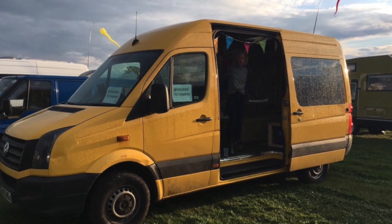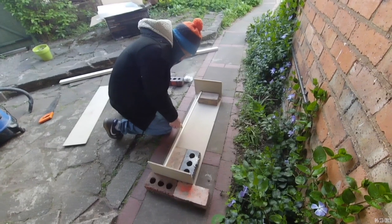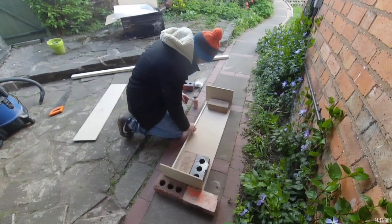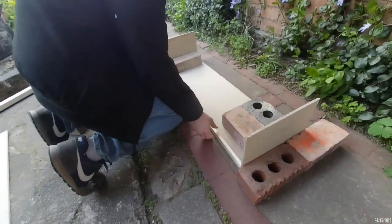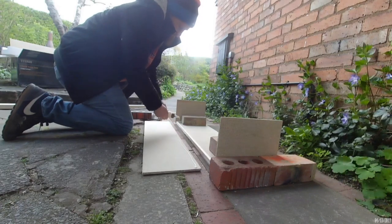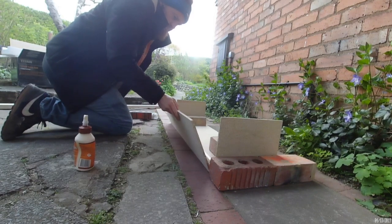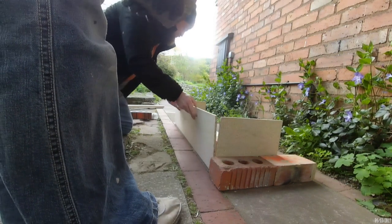And built the cabinets, so it looks like this - let's go! Here I'm building the wheel arch covers. We had loads of scraps of wood that we wanted to use, so I did, but because some of them were so thin it was hard to screw them together without the ply splitting. So we used some wood glue and some square doweling to hold all of the pieces in position, and used bricks to weigh them down whilst the glue dried.